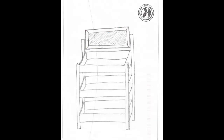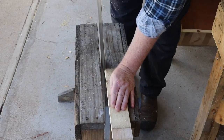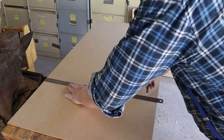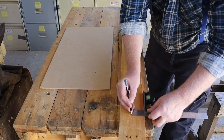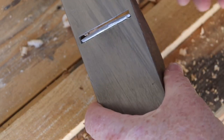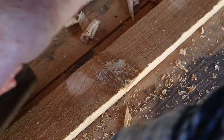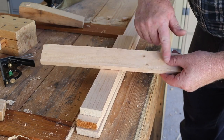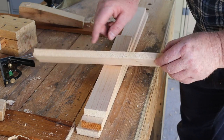Now we can start work on the chalkboard. First we'll need two horizontal rails to support the chalkboard — we'll measure, mark, cut and fit these rails using our usual methods. I'll use this smooth MDF board to make the chalkboards. I'm going to make a frame for the chalkboard from this piece of pallet wood — I'll mark and saw the parts in the usual way. Next I'm going to use my father's old USSR plane to smooth these parts; its blade is ground to a curve which works well in this knotty wood. I've planed one face and one edge of each frame piece — the rough face will be glued to the MDF board and the second edge will be planed in the next step.